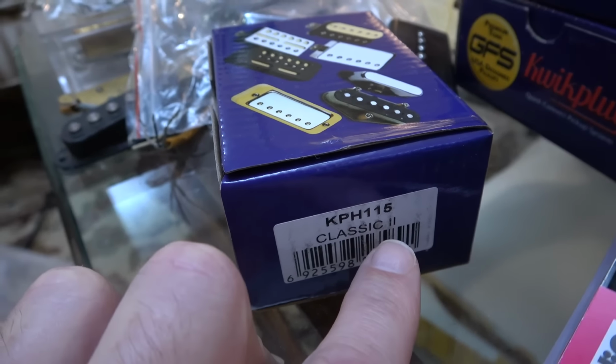So I'm going to use the two leads that we have coming off of the pickguard here, and we're going to run it to my little bench test amp, and we're just going to tap on the pickups to make sure we're getting what we expect to get. Okay, so we're good there. Our blend. See, there's our blend.